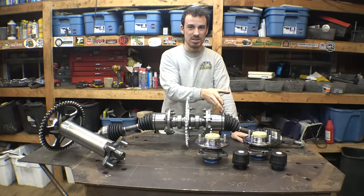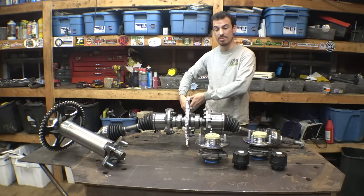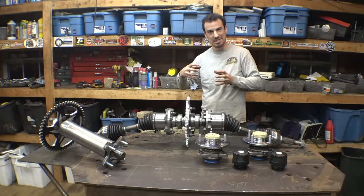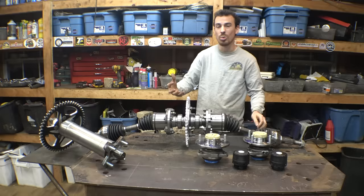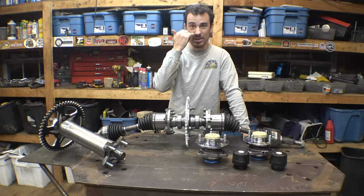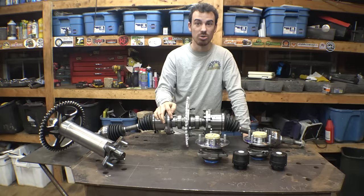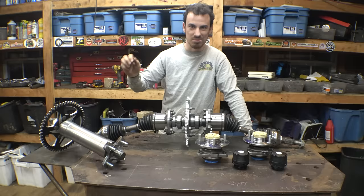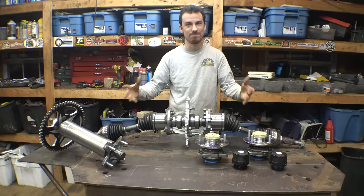And on the jack shaft for the chain that's going to be going to this, I'm going to be making a half of one of my two-speed transmissions, to where I just move a lever and it disengages the sprocket that's going from the jack shaft to the chain, so therefore in two-wheel drive, that chain and this setup is not spinning, so we don't have that noise and that extra drag on this vehicle in two-wheel drive. And in four-wheel drive, I basically just have to move a lever to engage that for the chain, and then I have to hit a button or move another lever to engage these, and then that engages four-wheel drive for this project. So that's how the four-wheel drive, chain-driven, whatever I'm calling this, is going to be working for this project.